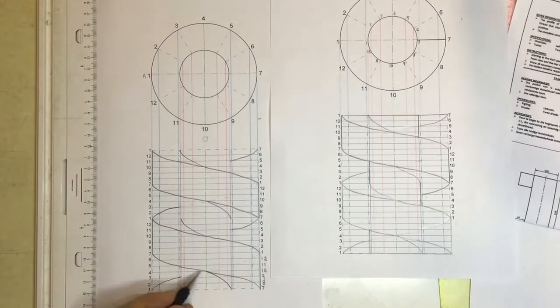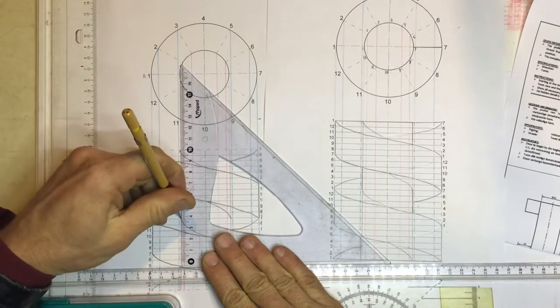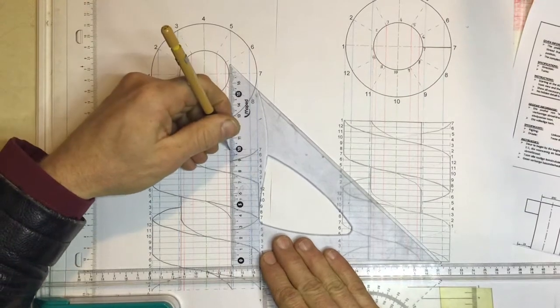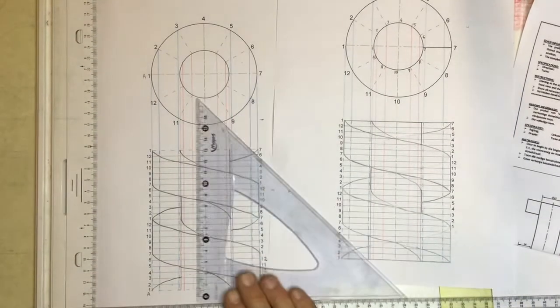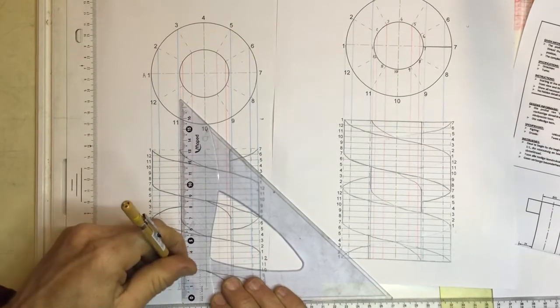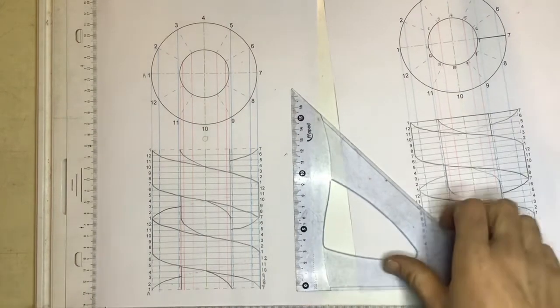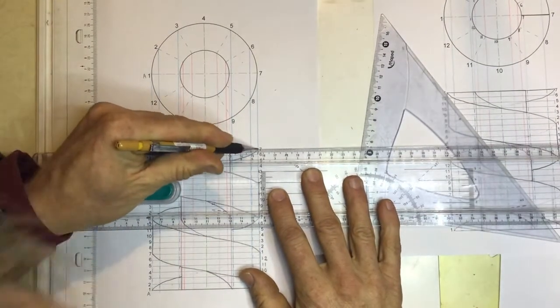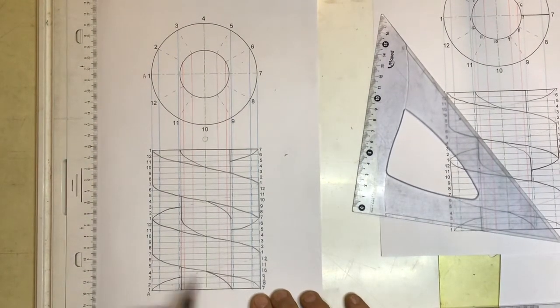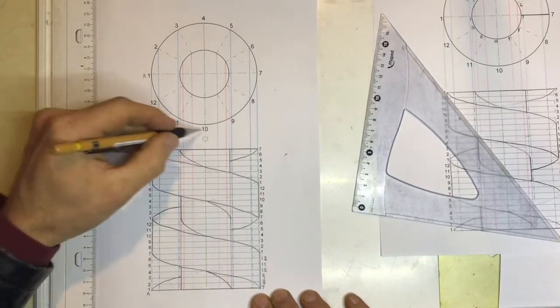Once we've got those things in place, I then need to draw in a line coming down showing the core, repeated across all four positions. Once I've done that, our square screw thread is completed. There is our left-hand square screw thread. You can draw a line going across the bottom and a line going across the top as well. Remember, you've got the helixes on the outside and the helixes in the core, which are very important. Look where they're going, look what you'll be able to see from where you're standing, and that's where the numbering comes into play.